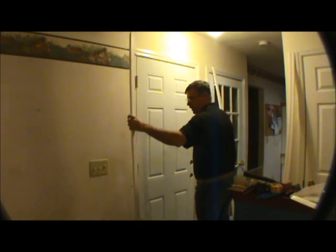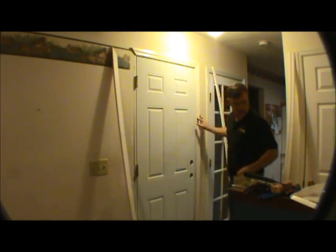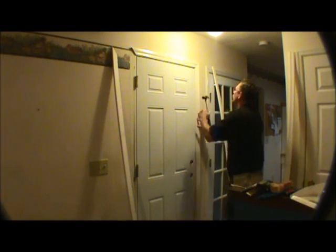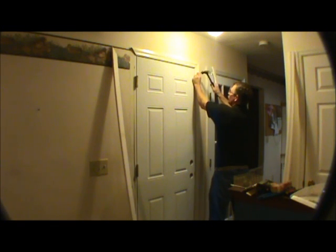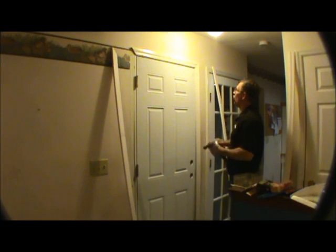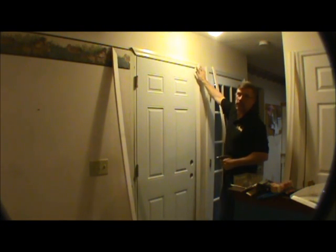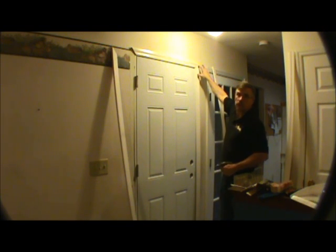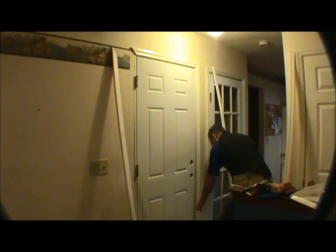And we're pretty much committed with our right side, so we're going to go ahead and take care of the right side first and just get it tacked in place with a couple of the larger finish nails. Now what you don't want to do with these larger nails is to get too close to your end, because it will split the wood. So you do want to hang away 4 or so inches away from any of your cut edges.